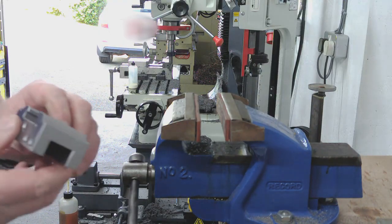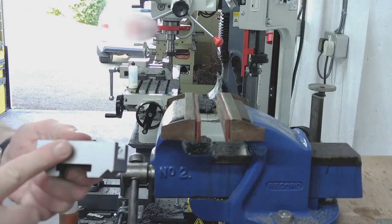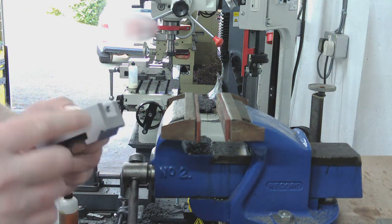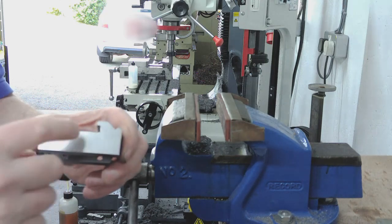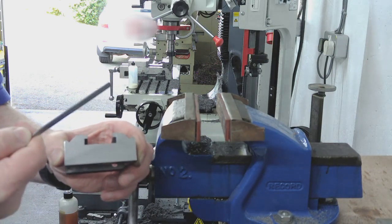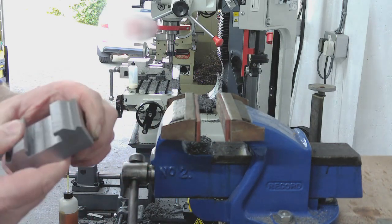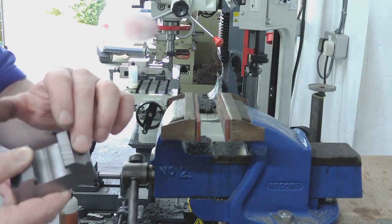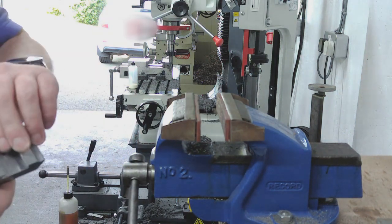We're on the final tidy up - they're all finished to final thickness on that bottom face, which has come out pretty decent from that end mill. I've been all over them with a file on the decent-sized edges, and in all the small areas and around the Vs I've been using a needle file to go around and get rid of all the burrs. I've also been using an oil stone to lightly stone the corners of the Vs to put a tiny break edge on the corner, which is in clearance on the tool post anyway.